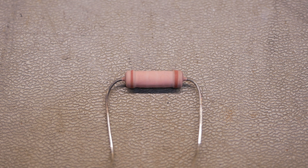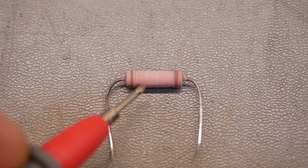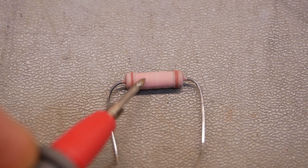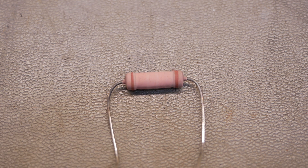Still within tolerance - it was probably just the fact that it raised its resistance so much. Now it's cooled down, it's probably 105, but you would not be trusting a resistor that's gone through that anymore. And as you can see, all the paint and the colour-coded lines have all disappeared, so you wouldn't be able to tell what value it was supposed to be in the first place if you didn't have any documentation.